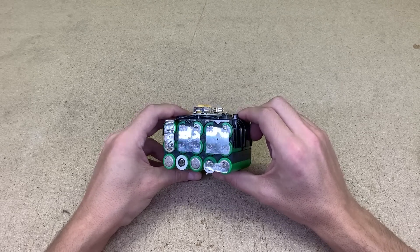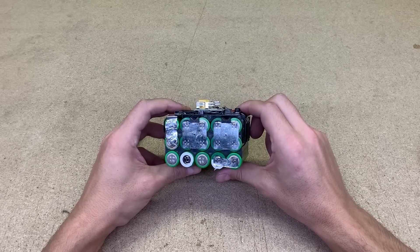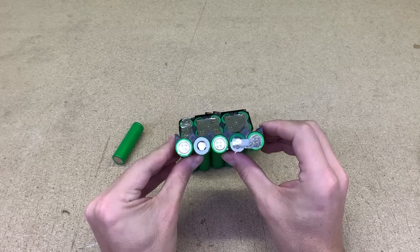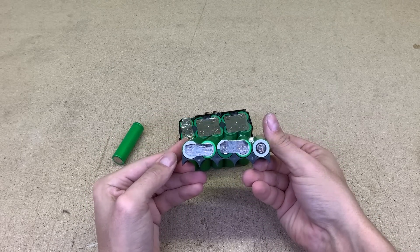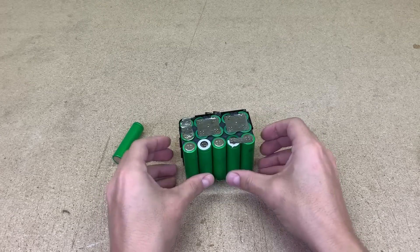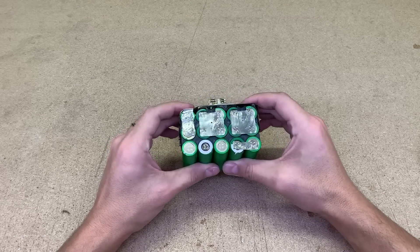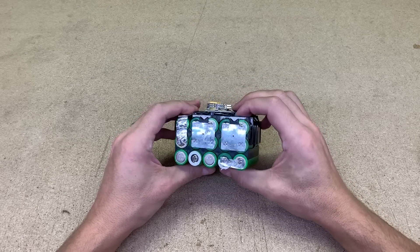This will allow us to use the power tool longer with its maximum torque and power. Cells will not overheat and will last way longer. Plus this will add 50% of total battery capacity. The only downside is the additional weight of the added 5 18650 cells — it is around 200 grams.